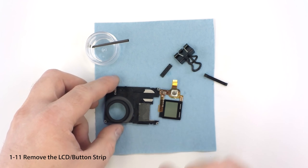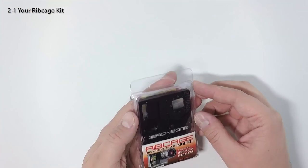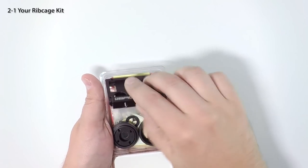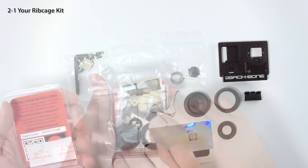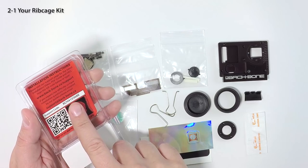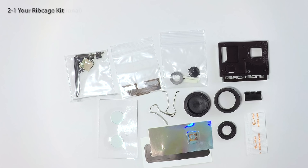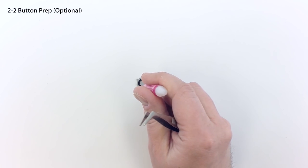The camera teardown is now complete. Now let's install the mod kit. Let's get started by opening up your kit and removing the contents. For a full list of parts, please view the PDF instructions listed on our support page. If you experience any difficulty or have questions during your install, please contact support — be sure to include your support code for the fastest possible service. It's better to ask first if you're not certain about any of the steps. If you want to use the original button instead of ours, place a dab of superglue on the back and add the button standoff with a pair of tweezers.